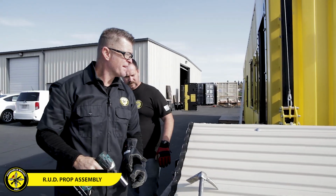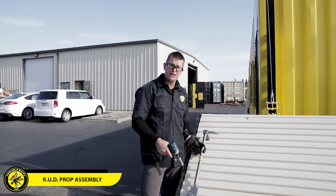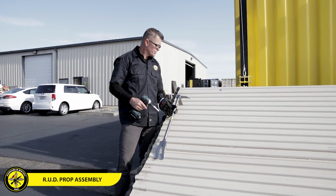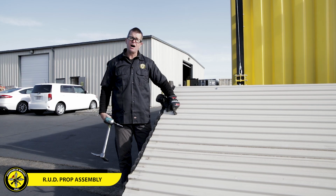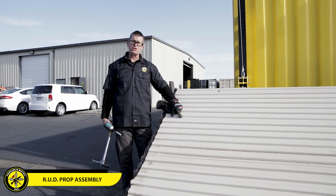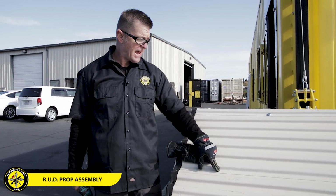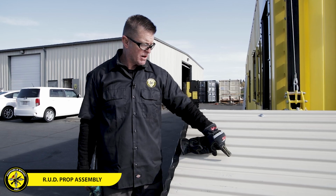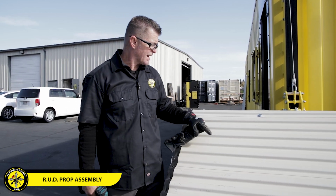All right. Believe it or not, this is what they call sheet curtain. It's not very heavy, typically made of about 20 gauge steel. You can see the seams in it. That's one of the indications that it's sheet curtain. This is the most common roll-up door being used right now. They're highly economical, and not nearly as heavy as the older school, what we call rolling steel doors. This is a really good example of a sheet curtain, and I just want you to see that.